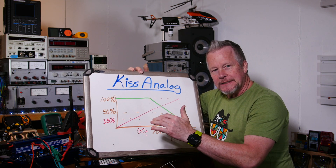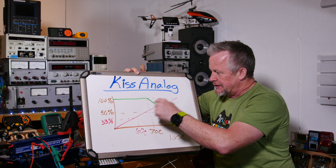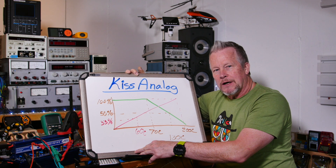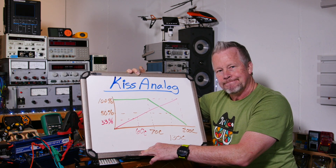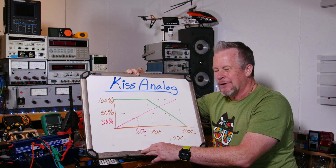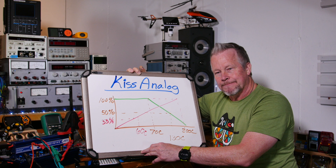I'm going to show you another curve. I transposed it from the data sheet and overlaid it with the first one. What it shows is that at 1 watt — about 33% of a 3 watt resistor — you're going to see a 60°C temperature rise. Starting at 20°C ambient, you'll be up around 80°C. That's pretty hot. This is why I recommend running resistors at around 25%, or no more than 33% if you really need to.